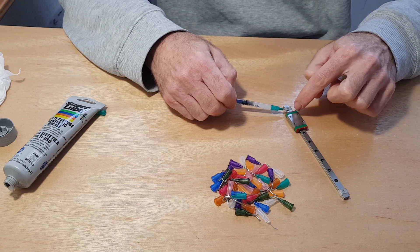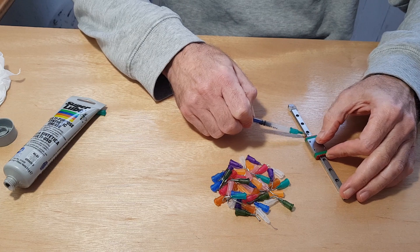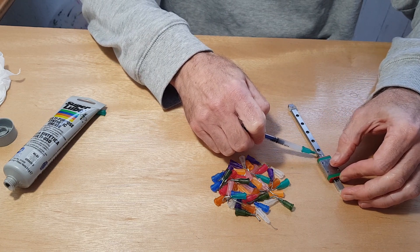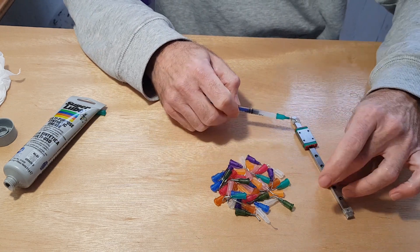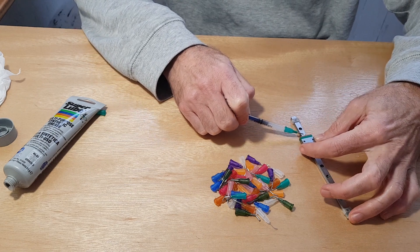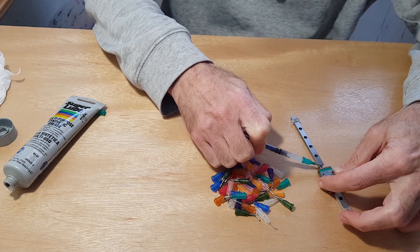As you inject, try and move the carriage along so that the bearings are rotating within the carriage — they'll take on the grease. You can slide in the other direction as well and just inject a bit more grease in there. Rotate it around and do it in the opposite direction. On your printer, just inject from both directions.